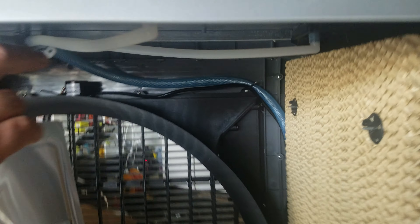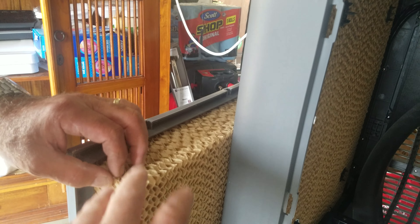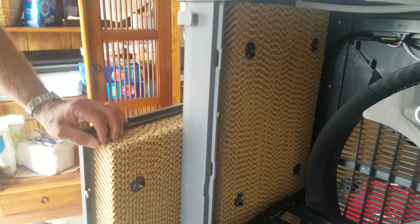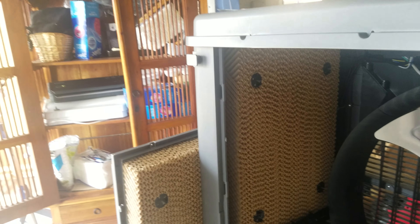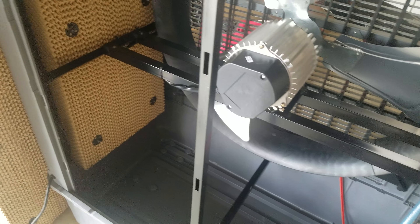Here's where the water comes down these things in here. See the sprayers? It pours down these filters that have a lot of surface area on them for the water. So these filters get all wet and that's what's doing the cooling. The nice part too — it's also filtering out dust and stuff because they're catching dust. We got to change this water of course and clean it and put bleach or something down and clean the water.